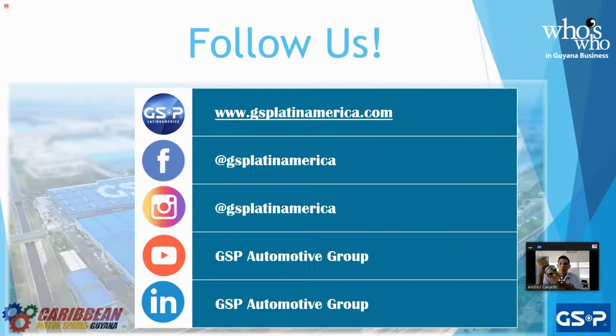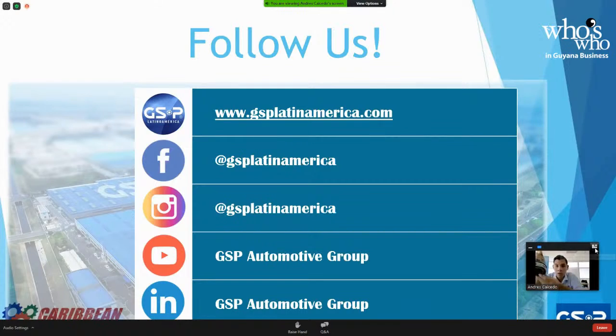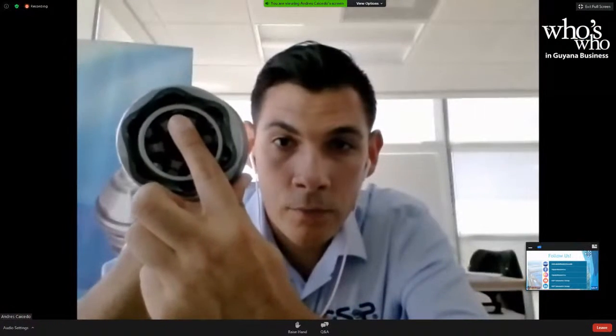Okay, I had a question here about the discoloration of the CV joint, right? Because it's not completely in silver all throughout. And on the bell, we also have these discolorations, these dots. This is part of the heat treatment. The next time you have a CV joint in your hand, you're going to notice that each one of these dots, each one of these burn marks, it's going to correspond to one of the bearings.